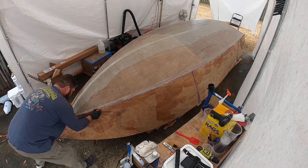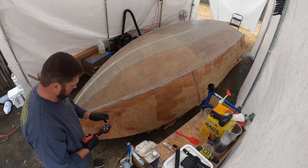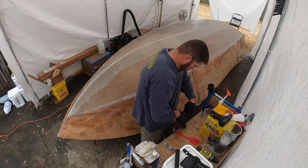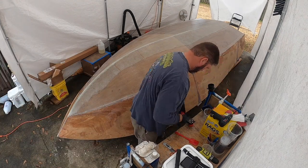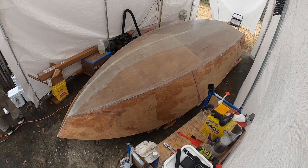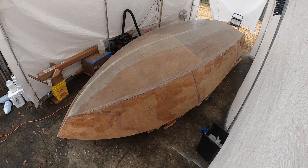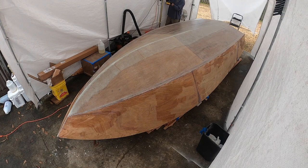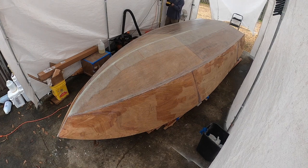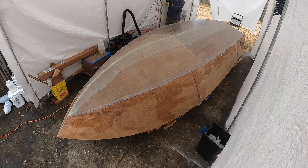I'm trying to cut it back on a little bit of a bevel. I had already pulled some thickened epoxy in that little pointed bow section from the day before - it was just a little more rigid than I'd prefer. I want to make sure this stuff lays down nice and pretty, so I take my scraper, come back in there, scrape all that off, and then use a little brush to make sure I have a clean surface.